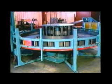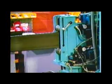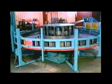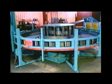Once the storage is replaced, the accumulator will automatically go into mill match mode. In this mode, the entry section speed of the line automatically matches the process section speed. The accumulator is full when it is in the mill match mode and nearly all of the material is at the outside diameter. Once the accumulator is full, it stays in the mill match mode until the end of the coil is reached. This mill match feature eliminates constant emptying and refilling.